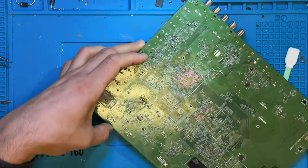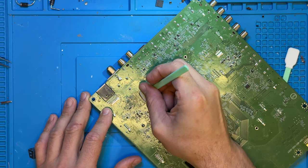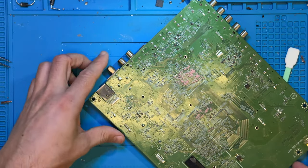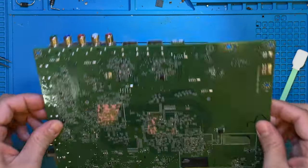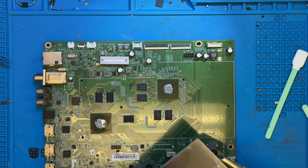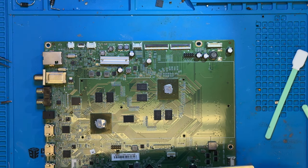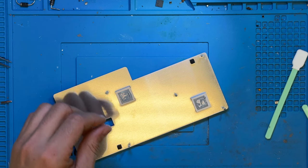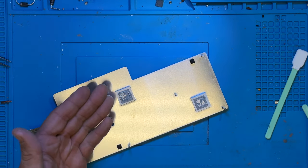The board is now nice and clean. I'll continue to show you the prep work here, since I have another video showing what we do in the hot air rework station. Next I move on to the heat sink itself. I want to make sure all the excess solder is also off these posts because you want them nice and clean so you can put the heat sink back on the board once the work is finished.